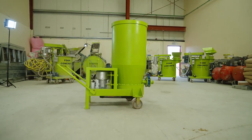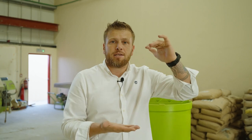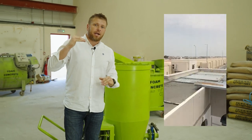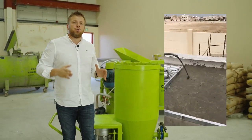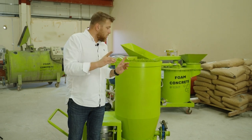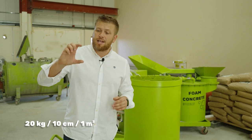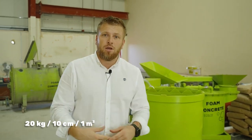It crushes them together and gives a low density result starting from 100 to 300 kg per cubic meter maximum. On average, this mixer is very suitable to make lightweight concrete up to 20 or 30 centimeters, and we especially created it for rooftop insulation at a concrete density of 200 kg per cubic meter.